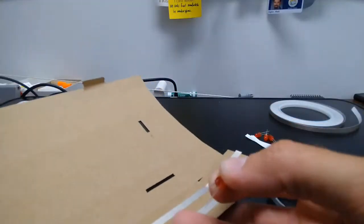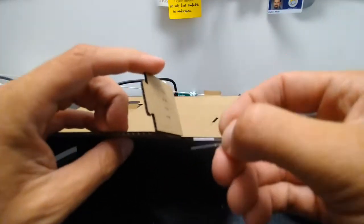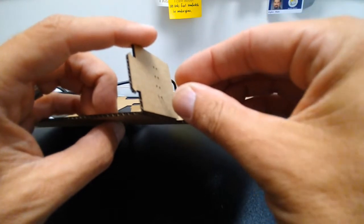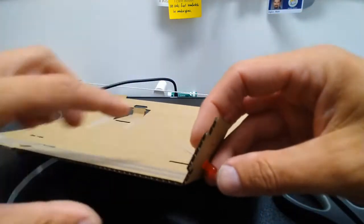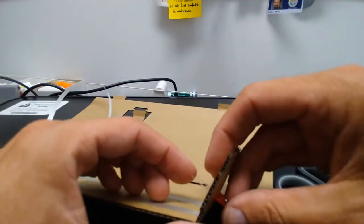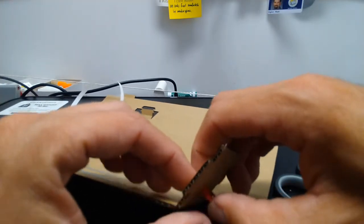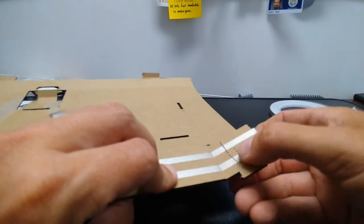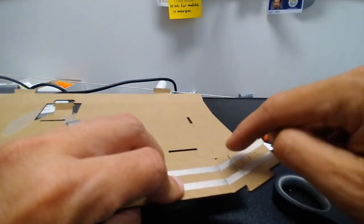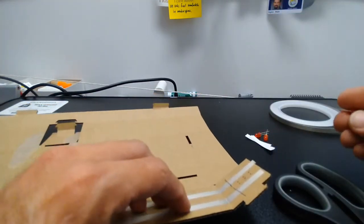So up here, I'm going to flip this over, and I'm going to put the LED through the hole with the longer leg over here on this side with the little break in it. And once I push it through, I'm going to bend those pins over. You don't want to bend them too much because they can break, and we've got extra LEDs should you need them, but that's what's going to allow me to make contact with the different sides of my circuit.